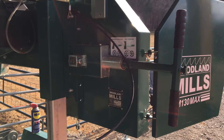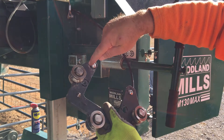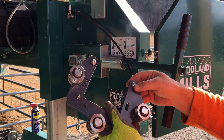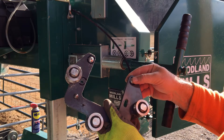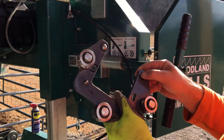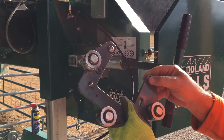I took the blade adjustment guide off to get to the bottom bushings, but I took a Sharpie and drew a line around each bolt and washer so that when I put it back I can line it right back up to where I took it off. I had fooled with this trying to get it adjusted just right to run level on that blade guide adjustment, and my goal is to put it back on just like I took it off.